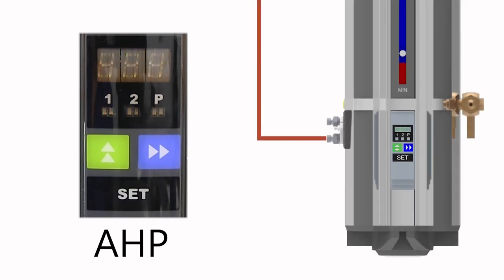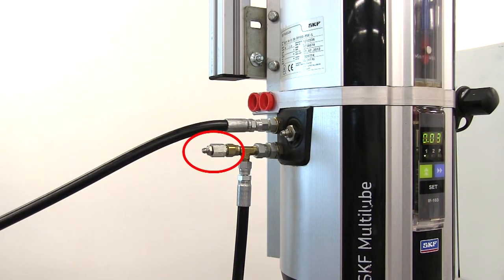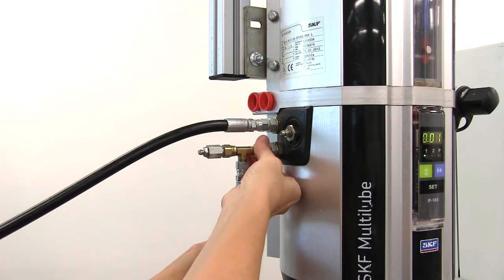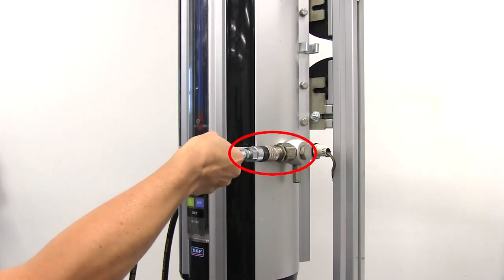AHP indicates the outlet port was above the low pressure set point at the start of the pumping cycle. The control unit relieves the pressure on the line after each pumping cycle, so under normal circumstances this back pressure wouldn't exist and the high pressure alarm won't happen, even if the line is blocked. The only way to get this alarm is if someone applies grease pressure to the outlet lines externally — for example, someone trying to fill the reservoir from a grease point on the outlet piping. If that's the case, try disconnecting the outlet port to remove the back pressure. Then either remove the manual grease point or install a check valve between it and the control unit so the grease point can only be used to fill the piping. Always fill the reservoir using the dedicated fill port.